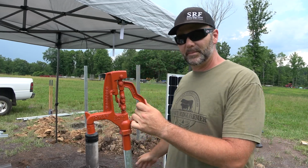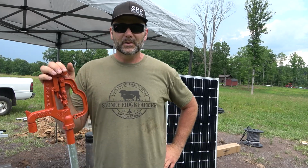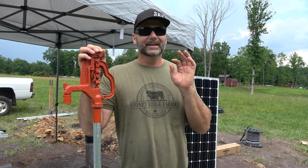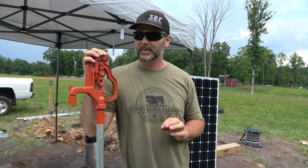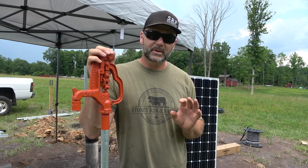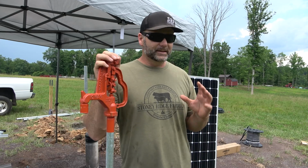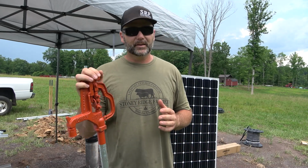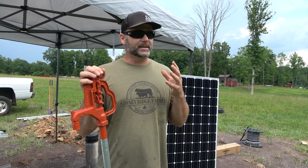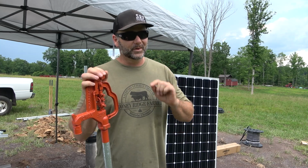Down here on our table and right back here behind us, I have a solar panel. How many watts is that solar panel, Eric? 200 watt solar panel. So we're going to be putting up 4 200 watt solar panels. We did get 8 200 watt solar panels, which is a ton of energy. All this is for is a tiny bit of irrigation once in a while if we have a really dry spell, and for watering our cows, so that'll be plenty. This system does not have a battery backup. In other words, it runs totally off of solar, so it's some interesting stuff. It's easier and cheaper and better on the environment to store water than it is to store electricity.